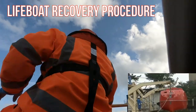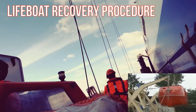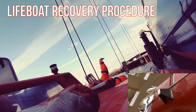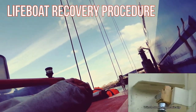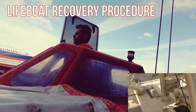Resume hoisting. When the davit arm approaches the stowed position, the davit arm strikes the limit switch and the boat winch stops automatically. Only after it has been confirmed that the winch has stopped completely may the crew disembark the lifeboat. Place two persons on the davit platform to oversee proper stowage.